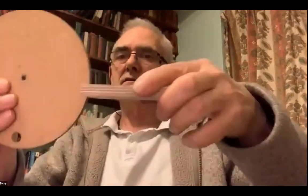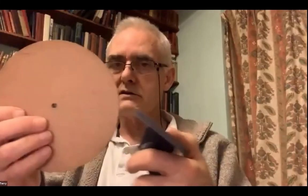Scrapers, you may have to slide it, you may not, depends on the size of the tool. The spindle roughing gouge, you just roll it like that against the stone. So those are easy. The tricky part is getting the angle right, getting this angle right here. You can buy systems, the Wolverine system, for example, works like that. And you can adjust it quickly to whatever you want. And there you are, and you can slide it in and out.